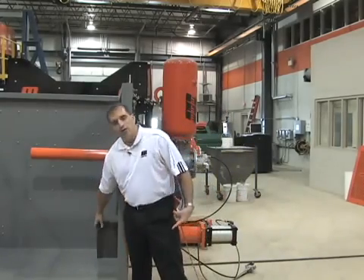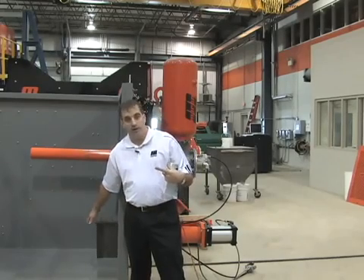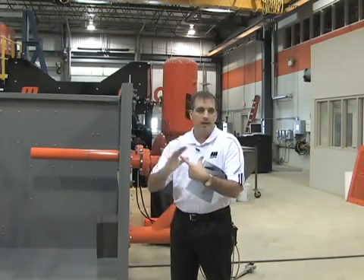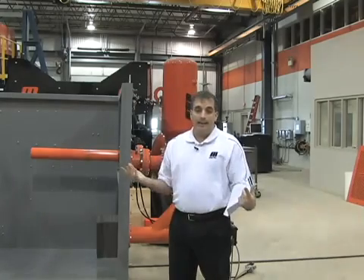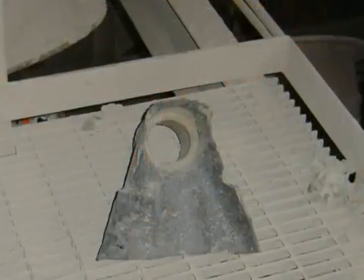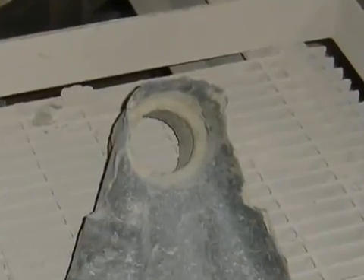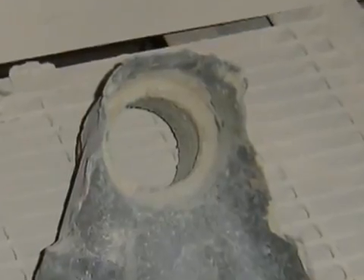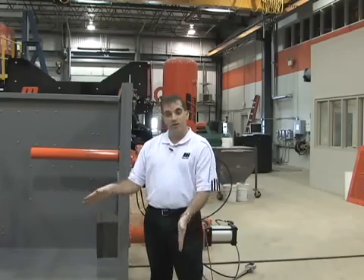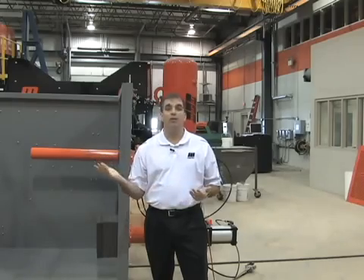Now even though these nozzles were made out of a very high-temperature alloy, they're exposed to severe temperatures and wear from the material. What would happen is if that nozzle wasn't protected with some refractory by a craftsman, those nozzles might last three or four months at best. After a few months you basically have a nice hole in your tower or in the nozzle — so instead of a unidirectional nozzle blasting toward the buildup you were trying to dislodge, you're just shooting a hole out into the tower — useless for the next several months of the campaign.